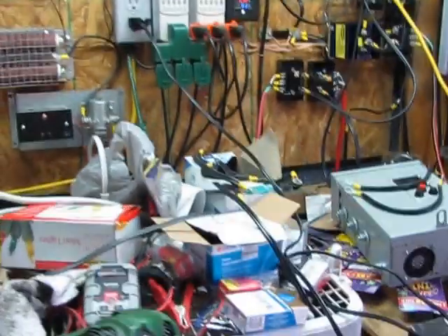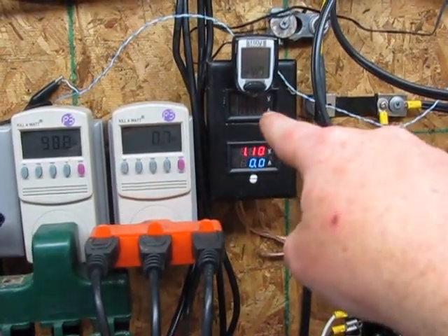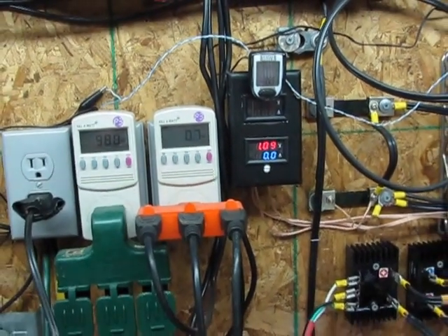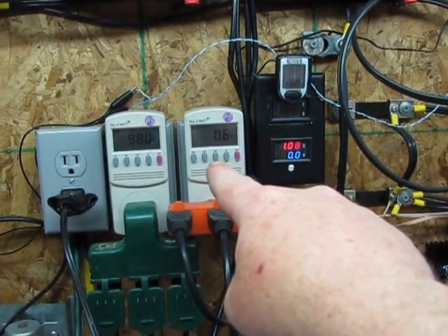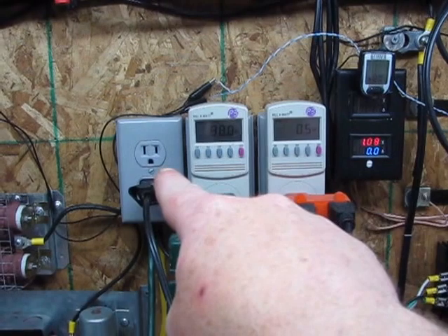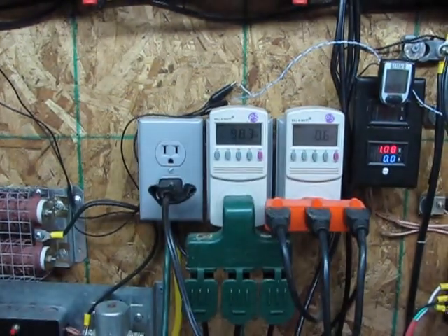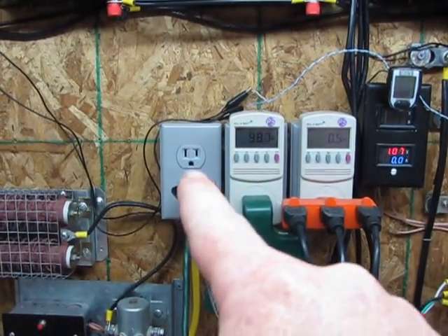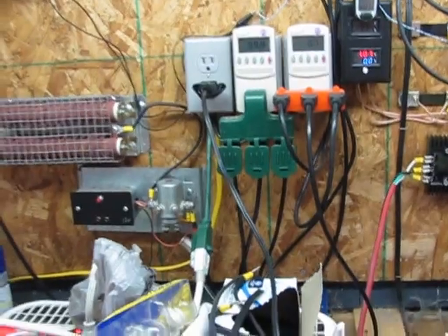I'm also going to be using these — I got two of these. One of them's there, it's not hooked up, but I'll be running that for the Freedom 2 and that one for the Freedom 1 that's on the front of my garage roof. So that way I'll have both my Freedoms running on these so you can see the amperage and voltage coming out of them. This is my wind turbine input — right now this is all 12 volt wind turbines hooked up — and solar input. Then I'll have the 24 volt input over here on that plug, with another one of these meters. So I'll have the 12 volt solar and 24 volt inputs — Freedom 2 over there and all my Missouri Wind and Solar is over here — so I can keep track of my power inputs better.